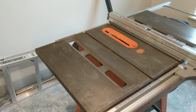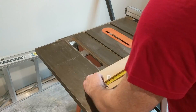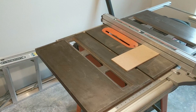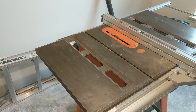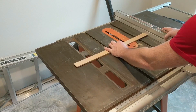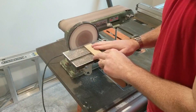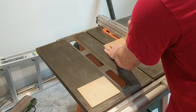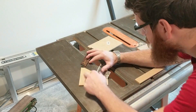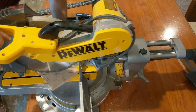Now on to building the enclosure. This part is pretty optional — in fact you could simply buy a pre-made enclosure and drill holes directly into it; it would cut out a lot of work, but I wanted to have the unique shape I ended up with. The total outside dimensions of the box should be the same as the overall dimensions of the face plate. The front and back pieces are the same width as the top and bottom edges of the front face, but the sides are the length of the sides of the front face minus the thickness of the material multiplied by two. This is important because you essentially want to be making a box that has the same outer dimensions as the face, except the front face of the box is much shorter to get that angled shape. I had the sides cut at an angle that started at one corner and ended on the opposite edge, the same distance up from the corner as the height of the front piece.